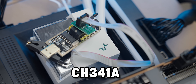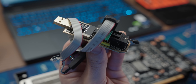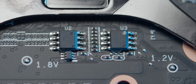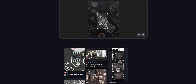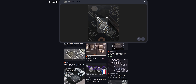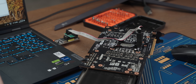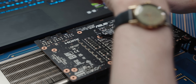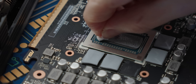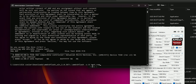Using a CH341A BIOS flasher is a dark art on the same level as voodoo — I have never had this not be a disaster. The problem started immediately when I couldn't identify what the BIOS chip was; Google searches returned random Japanese websites and Google Lens spat out generic chip pictures. I eventually gave up on identification and then couldn't get any reading off the chip — getting that clip to properly attach takes dozens of attempts. After two failures I even second-guessed whether these were the BIOS chips at all, removed the cooler entirely, and checked the other side of the PCB, where there was nothing BIOS-chip-shaped.